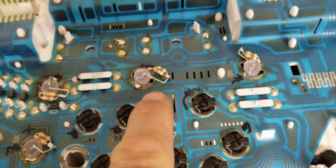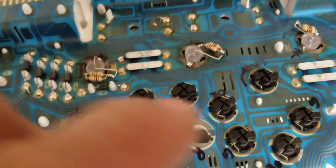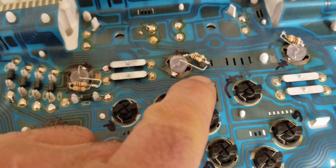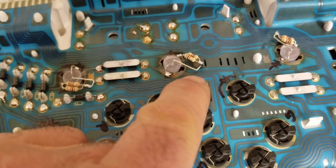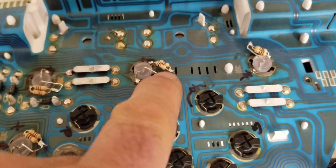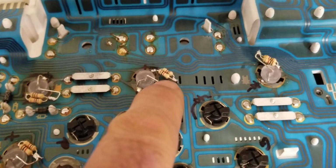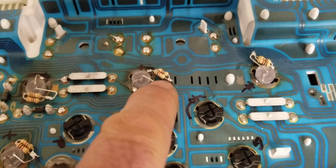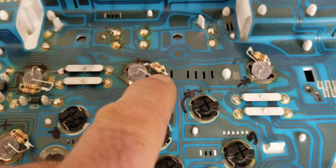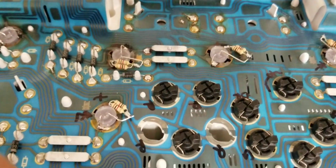You see the resistors. Because of these big fat LEDs, they need a limiting resistor, and I've used 1 kilo ohm resistors in parallel, and I tested it and they don't get warm. Now I have two quarter-watt resistors, which makes half a watt total, and two 1 kilo ohm in parallel means 500 ohms in total. It's better than the 200 ohms they recommended for me, because I noticed these LEDs give me pretty good light.